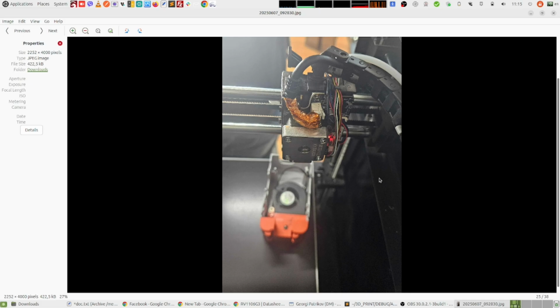And the second thing I learned is that there is a design flaw on this printer on the back side of the hotbed. There is only one axis, and that causes a wobbling on the back side of the build plate, on the back side of the hotbed. And in order to mitigate that, in the second video, you can find in the description the 3D model of a bracket that I used to support the backside of the hotbed. And that still is not solving the issue completely. So I think that this printer should have two axes on the back instead of one.